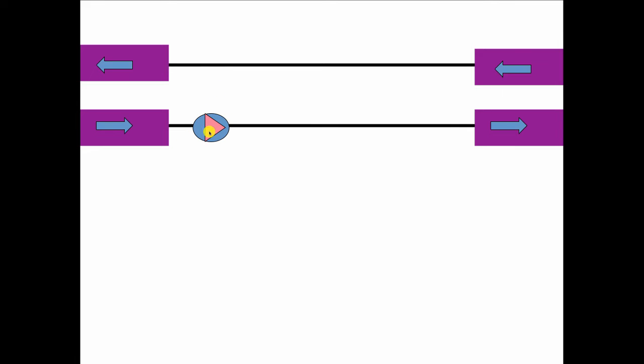And in this line, we put a circulator that was high flow, low head. So at the time, we used a Bell & Gossett Series 100, which was the right circulator for this. That was the classic circulator when converting gravity hot water heat. So it could also be something like a Taco 0010 that has a similar pump performance curve. So you're trying to move a lot of water against very little resistance to flow, because when the water's in this big pipe, it thinks it's in the ocean. There's hardly any resistance at all out here. So we flow through here.